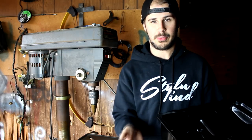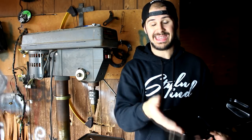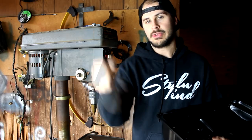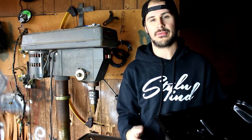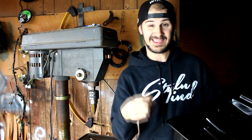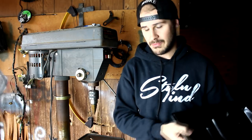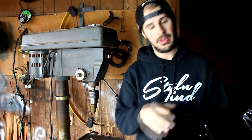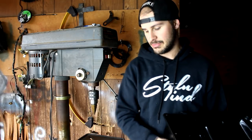The reason that's so important is you don't want the oil going down the drain tube and running into a place where it can't go into the oil pan because it's too low. It'll back up into your turbo, and it'll get that oil extremely hot from the exhaust gases, and it'll coat and turn to a solid, which will eventually destroy your turbocharger. Whether it's a China charger or a high dollar charger, we don't want any of that to happen. We don't want to be destroying parts.